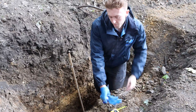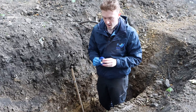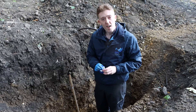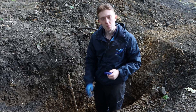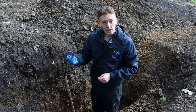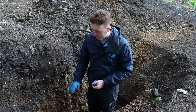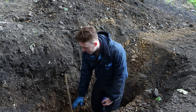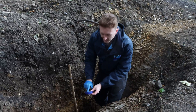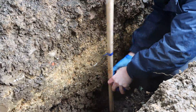I'm just measuring the depth of this hole which has been dug, and I've marked my measurements on there — the 75% fullness level, the 50% fullness level, and the 25% fullness level. I'm going to put some electric tape on those markers. When this hole gets full with water, the water level will start up high, and once it infiltrates down through the ground, it will reach these tape markers on the pole and we can time how long that's taken.